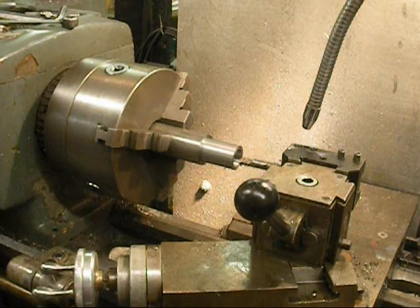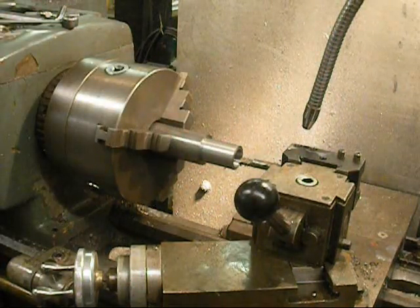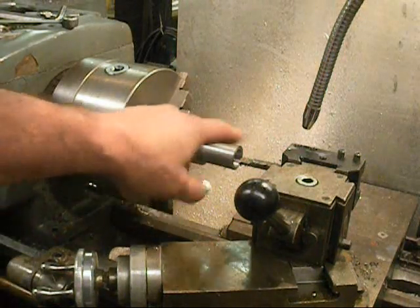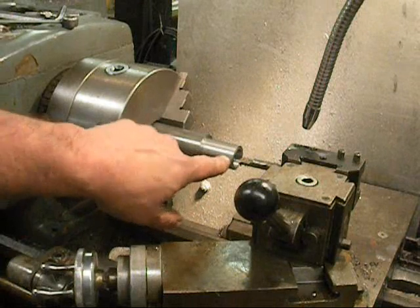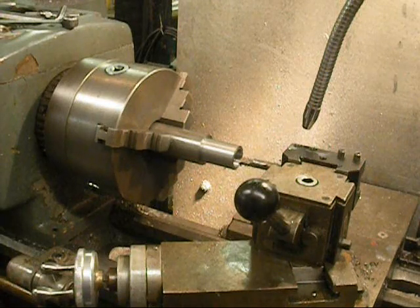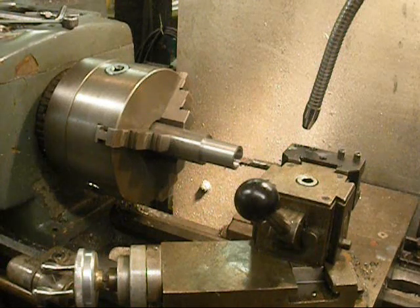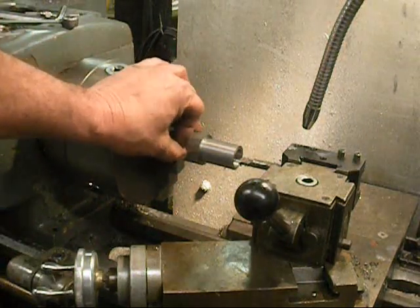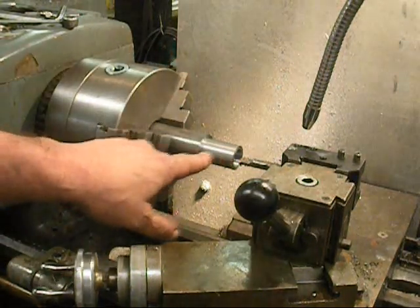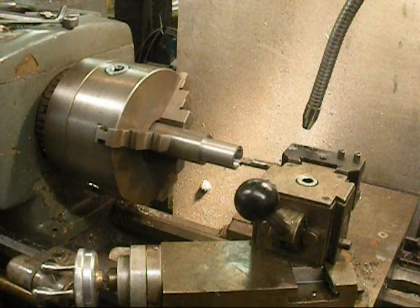This is the setup I'm using to make the bushings - pretty simple. We really didn't know what the outside dimension was going to be until we bored out that web. I'll make the next one exactly the same now that we know what to turn the outside down to. I used the boring bar - that was easy. I bored the inside for the pin while the other one was boring - two thousandths press fit, same as OEM, and I'm going to weld this crankshaft anyway. One important note for educational purposes: never take the piece out of the chuck when making a bushing like this. This is extremely accurate work. Do the outside, cut it to dimension, bore the inside to dimension, then part off and finish the edges. That's how we're making the bushings.